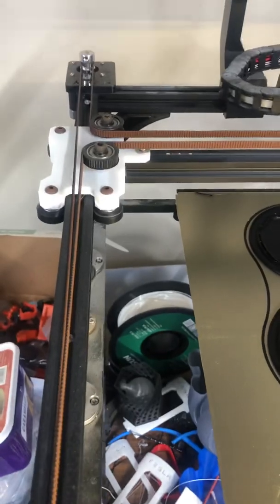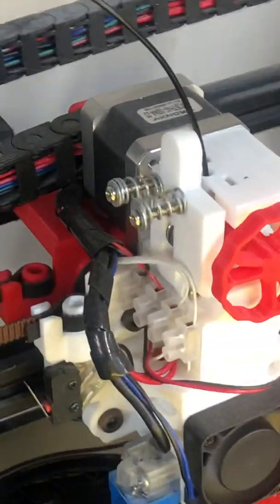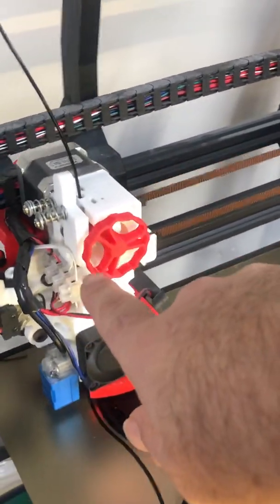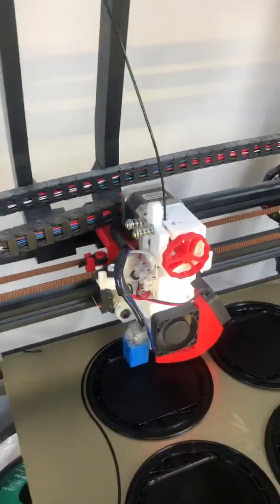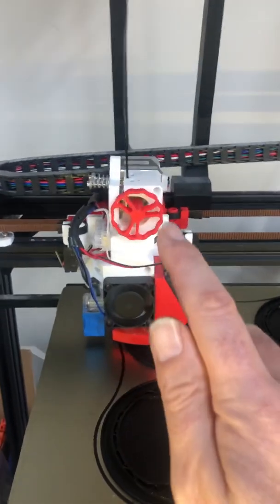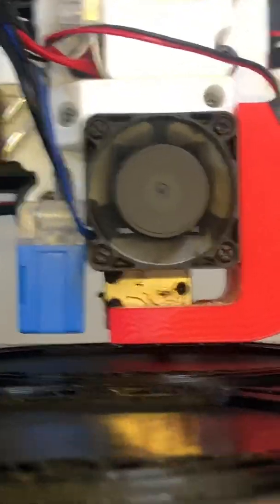That's the next thing you have to sort out. After that I went for a direct drive conversion. I used this design from Coza Maker on Thingiverse and I've made a few additions of my own — I've screwed the level sensor onto the side and added a terminal block to allow me to change items without having to de-wire the whole thing. I like Coza Maker's design because it uses the original extruder motor and gear but feeds directly into a V6 hotend with a round heatsink, and the fan is ducted to blow only at that heatsink. That's a dramatic improvement over the Tronxy design.